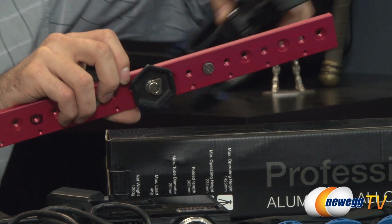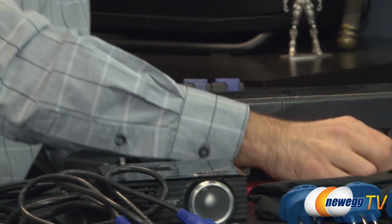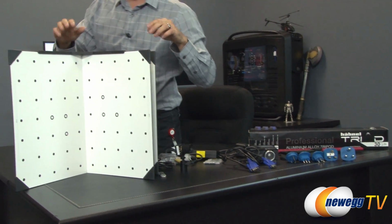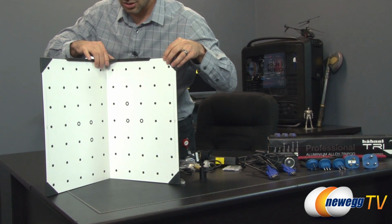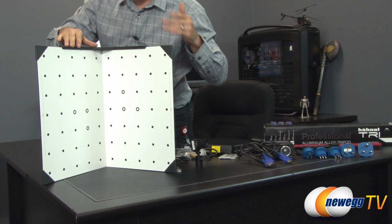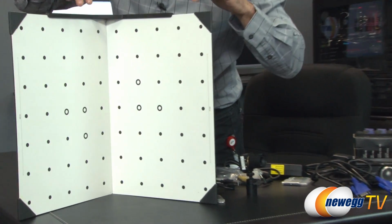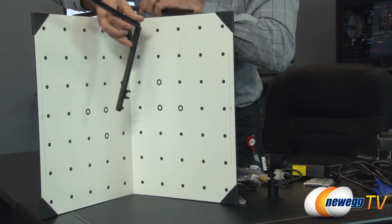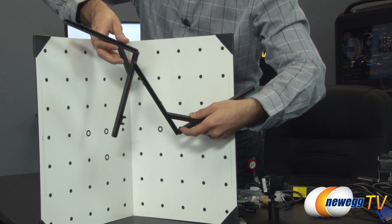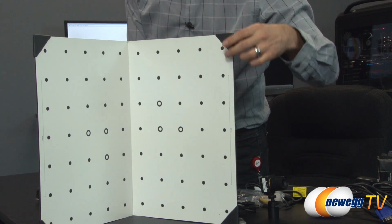Now, all of this is just so you can get the camera and the projector in position to be able to scan against one of these calibration panels. The calibration panels are intended to allow the system to calibrate, obviously, based on the size object you're trying to scan. This bigger one here is 240 millimeter, and what you do is you'd attach two of these 90-degree angle braces at the top and the bottom to keep it locked in at 90 degrees.